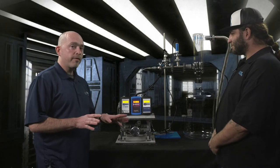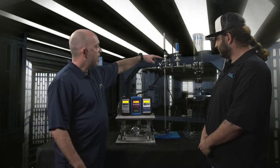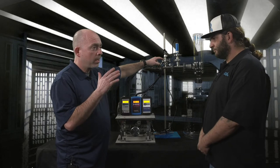A lot of people are familiar with the SVG-1. This is the vacuum gauge that a lot of people use for short path. It works really well, has a very wide measurement range, and the sensor is very inexpensive. It works great from a millitorr to about six torr, so if you're doing short path at 100 millitorr or 200 millitorr, this is the one to use.